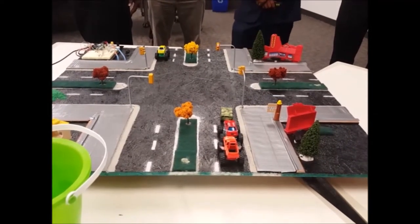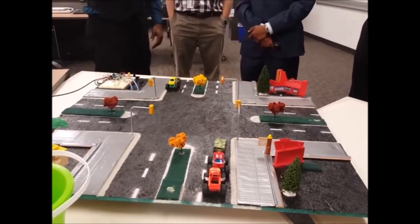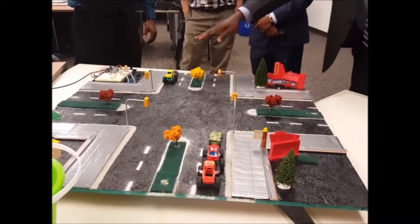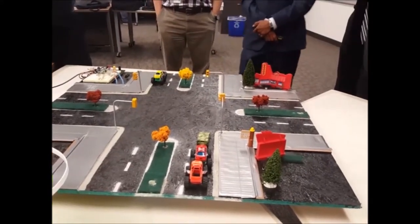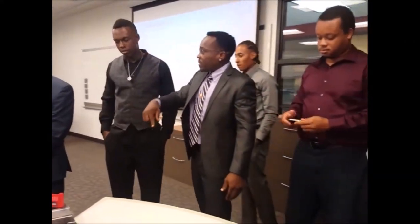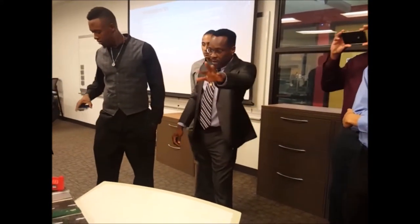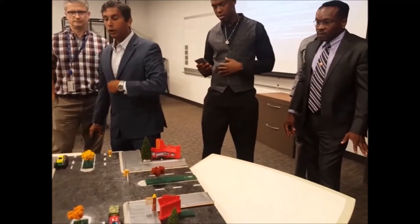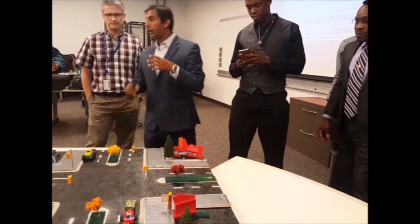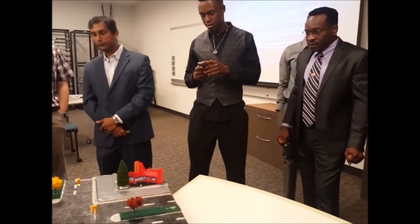That's cool. Now it's going to start reading the sensors. It reads those cars that stop right here. Even though you see we got green, you see it quickly change. When you count this, you will realize that this green light is going to stay longer than the other two that just passed. Right now, it senses 3 vehicles on the southbound and 2 vehicles on the northbound. It will let it go for a longer period of time, around 40 to 50 seconds, and we'll keep green on for that side.